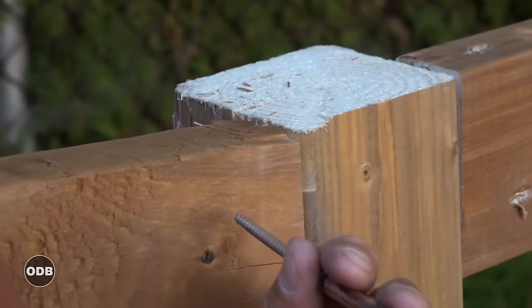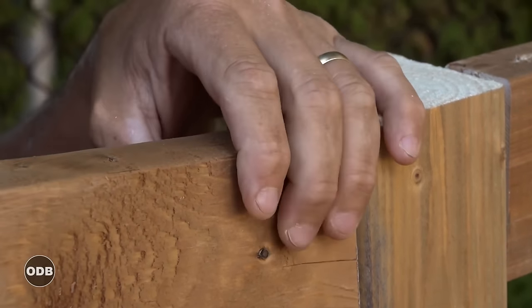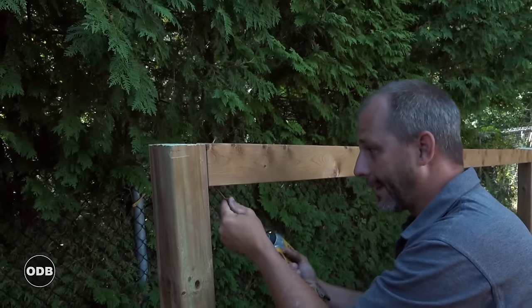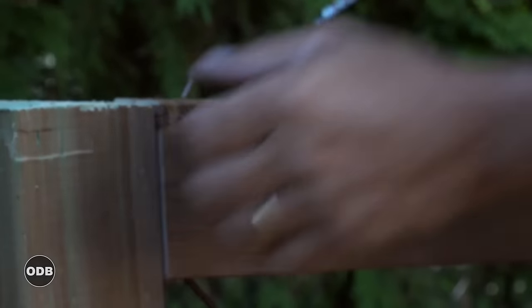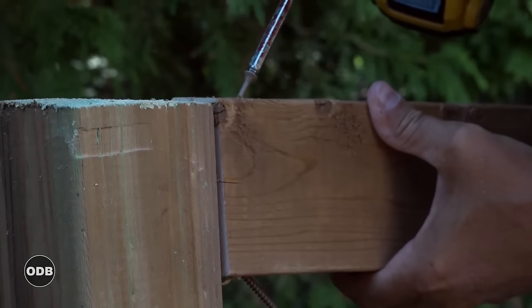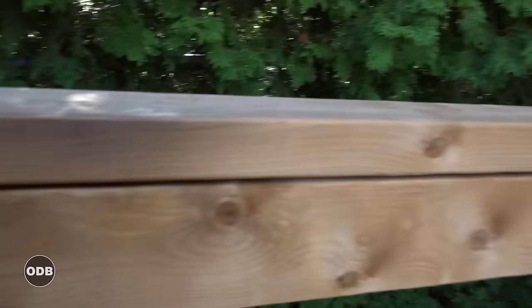This one's sitting a little bit high. I've started that screw and I'm backing this one out of the way — when I drive the screw down, the angle of it will pull the two-by-four down the four-by-four post so you can get it nice and close. Perfect. Now we're going to install our top cap, which is very important especially in outdoor construction.